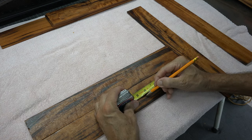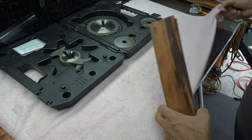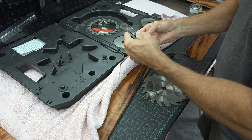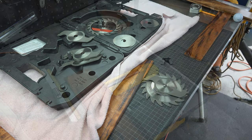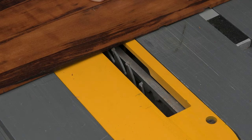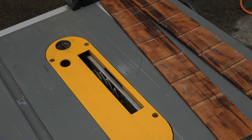If it does not end up perfect, I can cut the sides to the desired width — I'm still making this up as I go along. To make sure each slot is the exact width of my planks, I pull out my dados and put a piece on its side and simply stack up the blades until I get the exact height of the board. Now later you will see that sanding has made some of these boards a bit smaller, but it will be manageable. With my blade set, I am going to cut each slot half the width of the board. I use my miter gauge and stack both pieces side by side ensuring they are flush on the edge, then just run each slot across the blade where I marked it. When you are finished, each slot should be exact on each board.